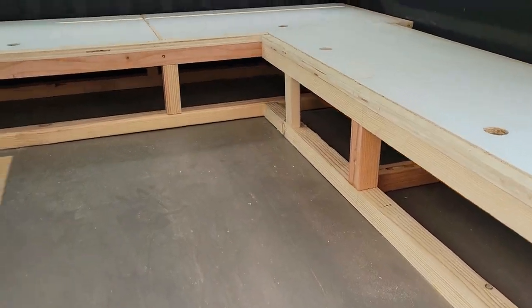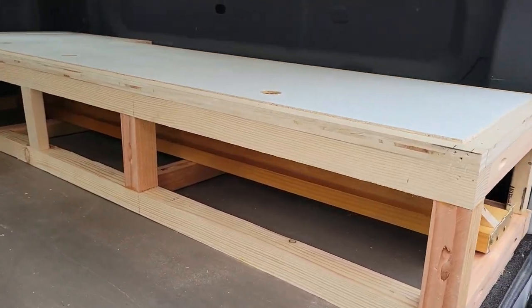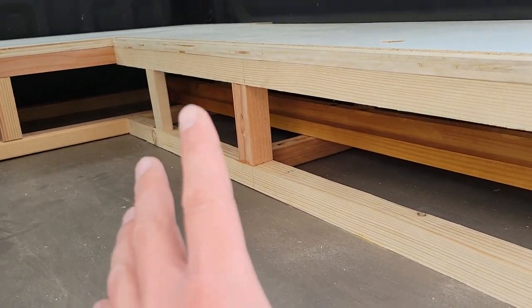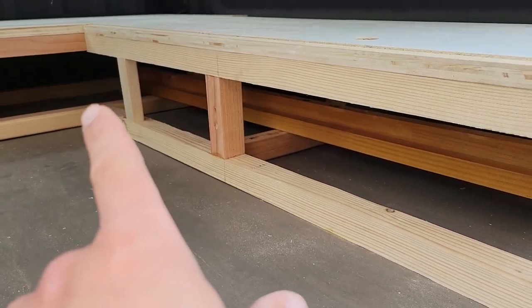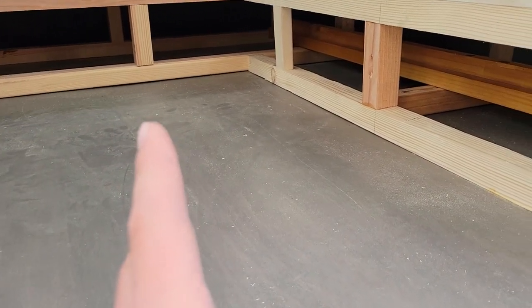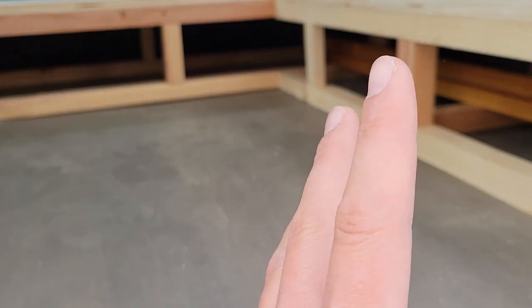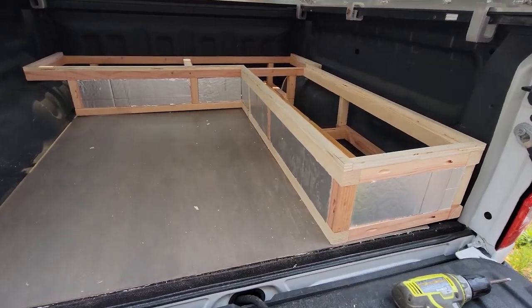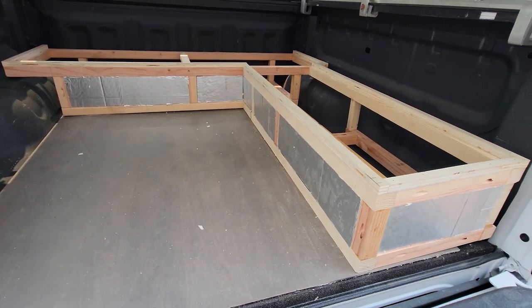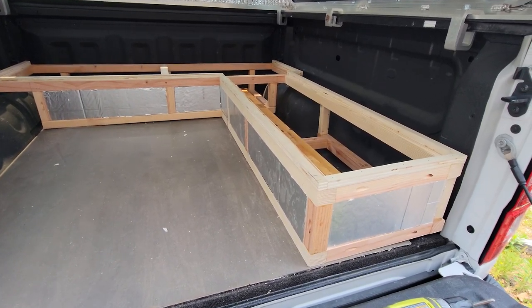Let's check it out. So before I close the front of these bad boys off with the finishing material, I want to set my insulation up here and just trace the openings from the inside. And that way the insulation that I cut to stick in the openings is a little bit larger, so it fits in there snug. All right, there we go. Front's all insulated. I'm gonna go ahead and cut these panels and finish off the face of them.